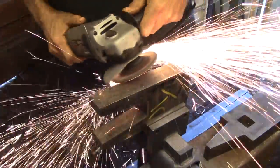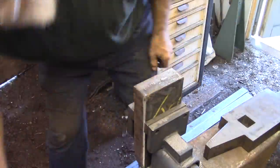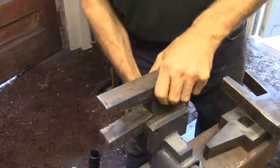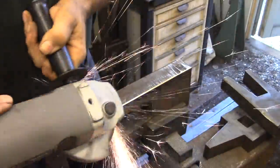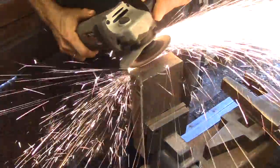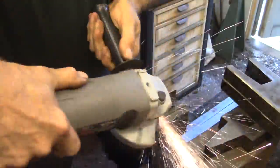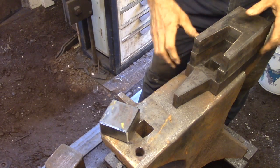At this point I'm done with all the file work I'm doing right now, so I'm ready to do the weld prep to assemble the actual anvil block. I'm not getting too carried away — just basically running a bead around the outside. I've had a lot of discussions with people about this and most people think it has to be one solid piece from the center on out, and I totally disagree with that. The main body of the anvil really isn't under a lot of stress. The welds just need to tie everything together so it can work as a unit and give you the mass you're looking for. The only exception is if you decided to put a hard steel face on this and heat treat it — that requires a lot more work. But a simple anvil like this that's just going to be welded up and left alone, that really isn't necessary.